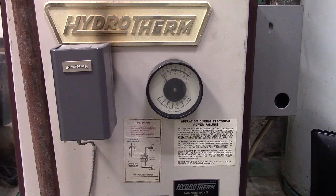The meter has come up. CO is reading 2 parts per million. I think that's more than perfectly acceptable. CO2 is close to 300. Air quality index is 1, which is excellent. That's the AQI. TVOC is 0. HCHO is 0.003. So we are looking at excellent numbers. And I'm not in any danger of carbon monoxide poisoning. In fact, it went down to 2 at this point.